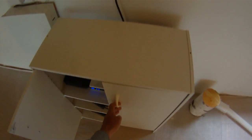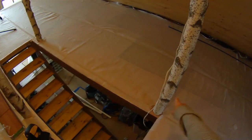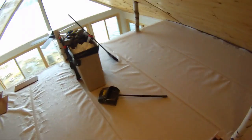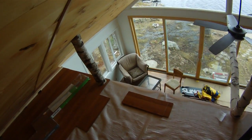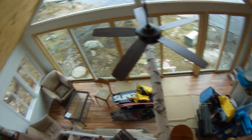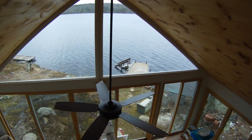The ceiling is finished — touched up a few spots. The alarm panel and excess wires were put into the closet, keeping the wiring clean while still having good airflow with the back left open. You can feel some heat coming out of there. The white birch trees are coming through the floor into the ceiling — a really neat look. They're screwed into the ceiling and floor with timber bolts in the ground for a secure connection. Metal wires will go between them as railings at about 32 inches high — still giving a nice view of the lake when sitting down.